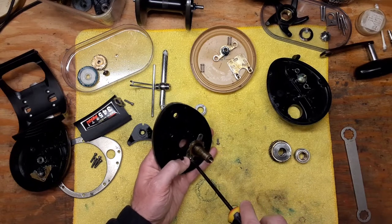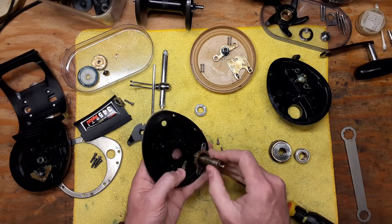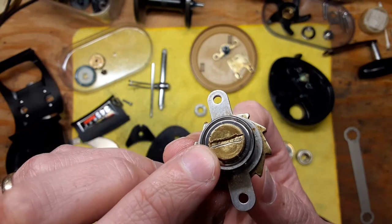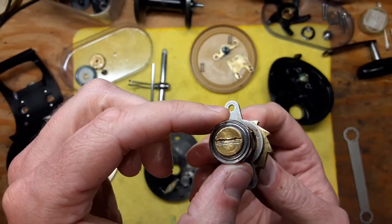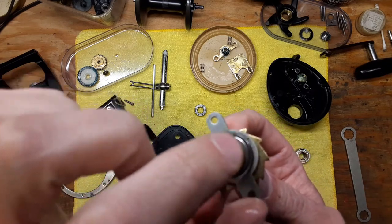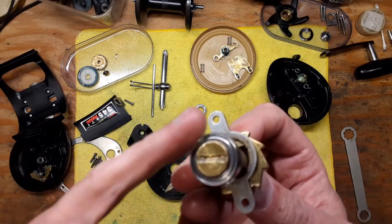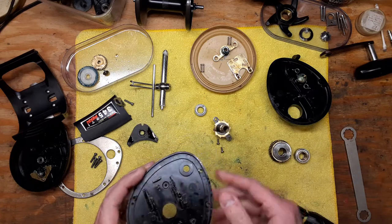There's one more bearing hiding under here. For this particular bearing I don't recommend attempting to take the inner ring off like the others. This screw is on very, very tight - they put Loctite on the threads and it's very difficult to get out. All you really need to do is clean it up and flood it with a little oil on top; the oil will seep down below the plate eventually. If a bearing spins freely it's in good shape. If it's seized, rusted, or corroded, then you may need to replace it.